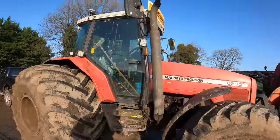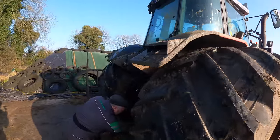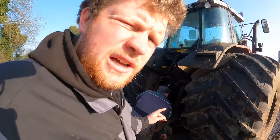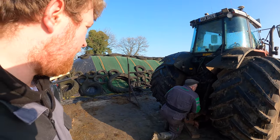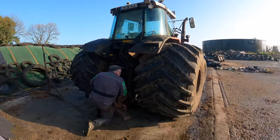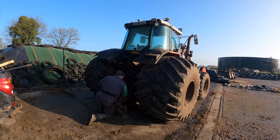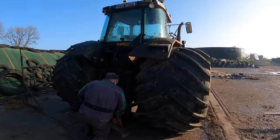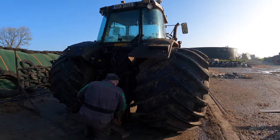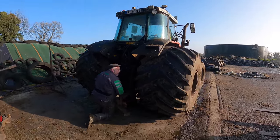The family's just getting ready to give us a hand to lift the wheel. We have the tractor running to warm up the back end oil so it flows out easier. We get the wheel taken off first, teleporter lined up, lift it up, and take it off. The wheel bearing on this side is what's gone, so we have to get that big wheel off to get at the half axle, half axle has to come off, then we take the half shaft out of the half axle to fit the new bearing.